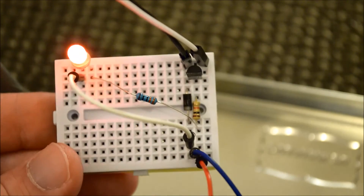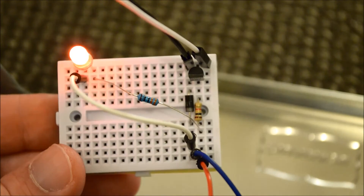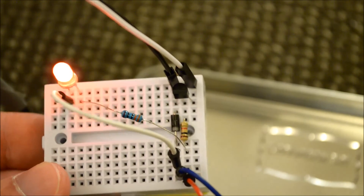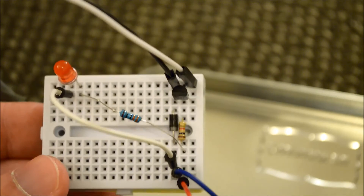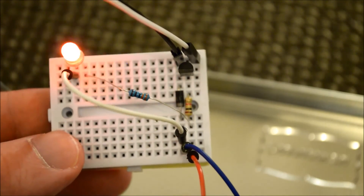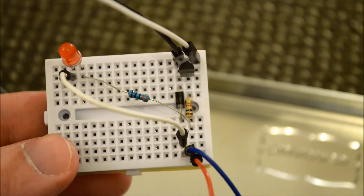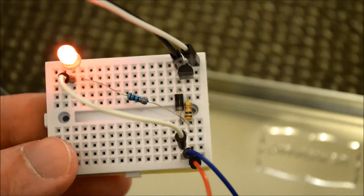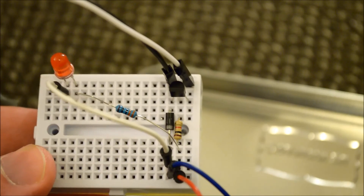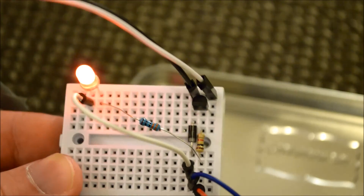So if you look down at the bottom, there is a blue lead which is ground and the red lead which is going to pin 13, which is the output from the Arduino. Pin 13 is being fed through a 1k resistor going to the base of an NPN transistor. I'm using an S9013 transistor but I believe any decent NPN will do. The ground is going through a small 1N4007 diode — that's just to protect the Arduino in case there's any back current coming off the QRP kit itself. So pin 13 goes to the base of the transistor, ground goes to the emitter, and the other lead, which connects to the QRP input plug, goes to the collector.